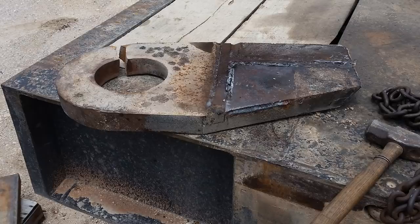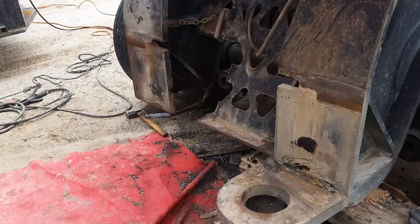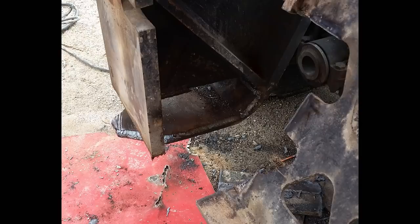You can see the perimeter welds around there. A couple feet of weld, but it wasn't that big a weld, maybe a 3/8, half inch weld. So in order to access some of it, you can see the center there, I had to cut out some of the center plate section to get to the top side of the weld, but that wasn't a big deal either. I just put it back on there when you're done, and then glue it all back together.